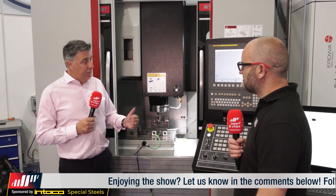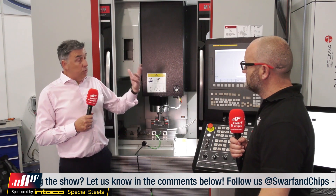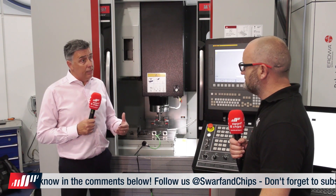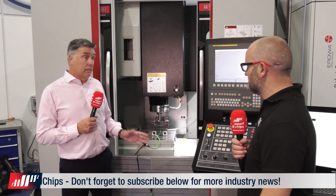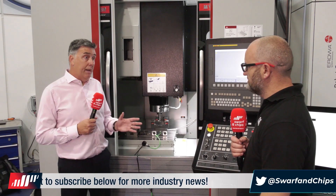What is Blum Nova Test suggesting — should an engineer buy this and keep it in their stores, or should a company like the Engineering Technology Group have one to do it on engineers' behalf, or a combination of both? I think a combination of the two. The first application we thought of was for guys like ETG, where they do PDI on machines before they're sent to customers — so they create a data reference of the spindle status before it leaves. Then periodically they can check the spindle and compare it to day one. But also for end users in the field with many machines, who can do an annual inspection as part of their service schedule, or sooner if needed, to evaluate early whether the spindle is showing signs of needing service.